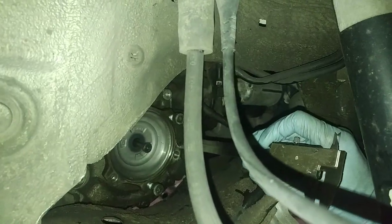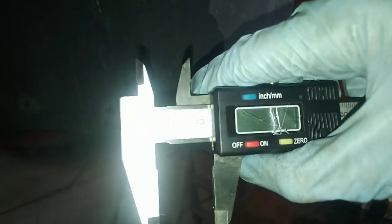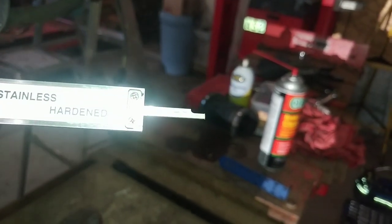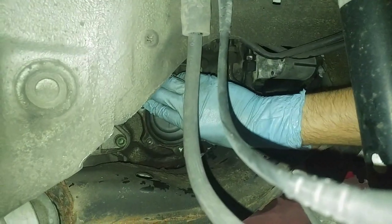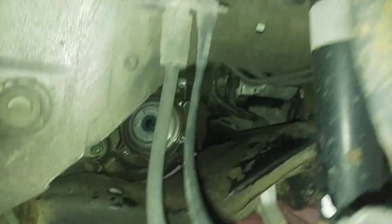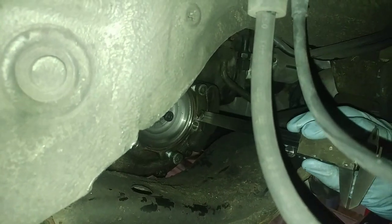I have a caliper here. I just put it in here right on the edge, slid it back, and took my measurement. I got roughly 24 millimeters — you can see how I did that, just the back of it sticks out there. So I got 24 millimeters, then grabbed the flange and pushed it in until it seats.